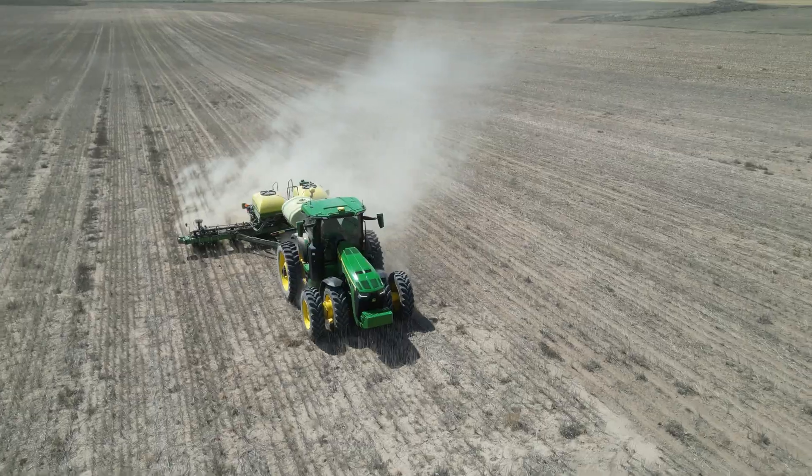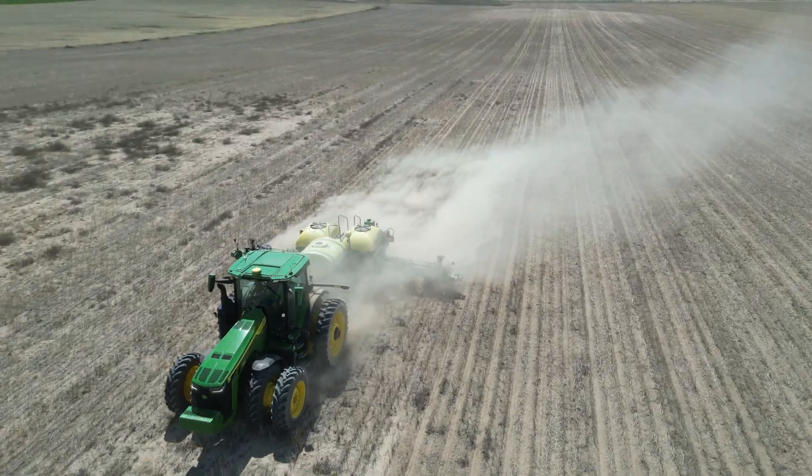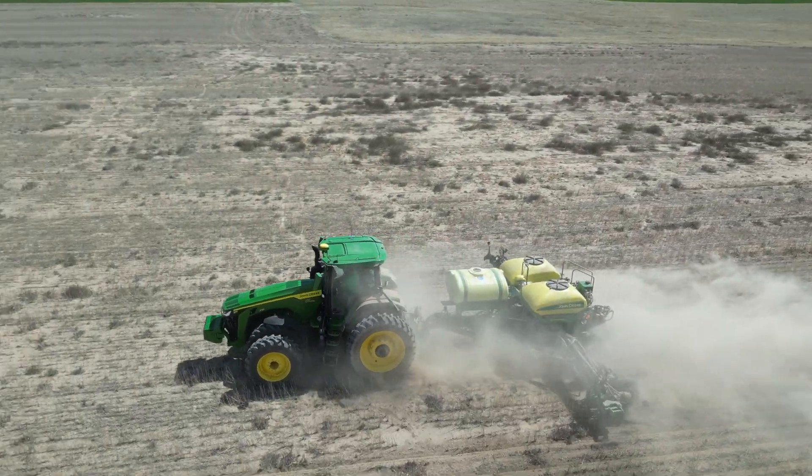Remembering the demos we did last year and this year — it's kind of cool to do a 100-acre field and only use less than 100 gallons. It's a definite change and it works great in dry land, because in the past you always had to fill up with fertilizer a lot more than seed. Now it's almost one-to-one, or you might even be filling up with seed more than fertilizer depending on your tank size.